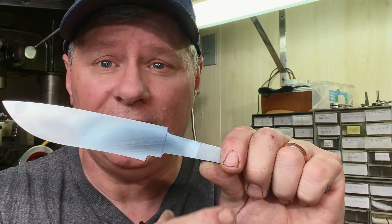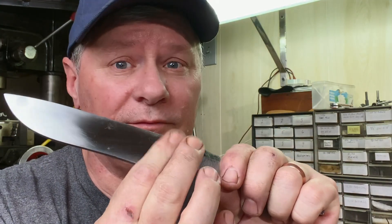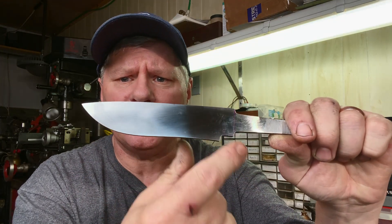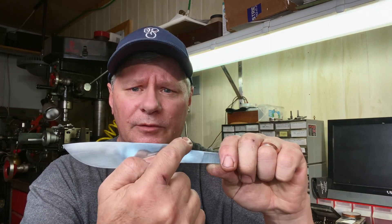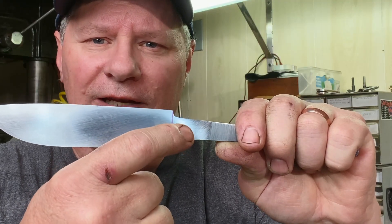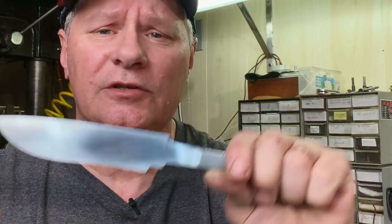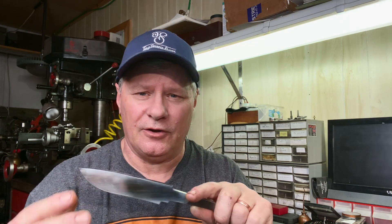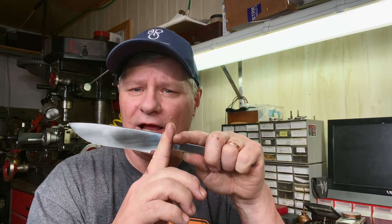That's pretty close right there. I've got our flat sanded and I've made sure it's flat and mic'd it out. You can see here I've got a mark where I want my guard shoulders to be. This mark is slightly forward at the bottom — ever so slightly — because if it's dead on square it'll often look like the guard is canted backwards a little bit, so it is ever so slightly angled.